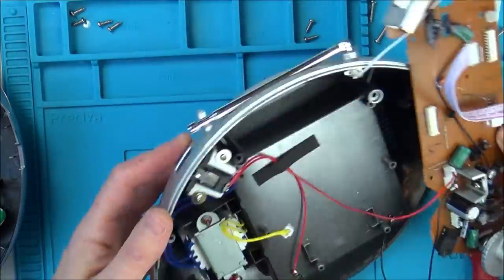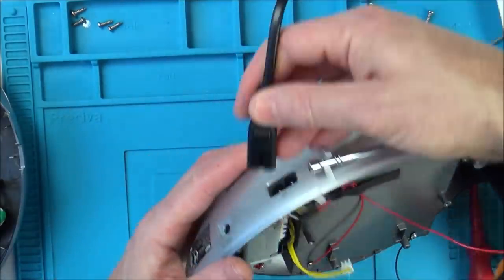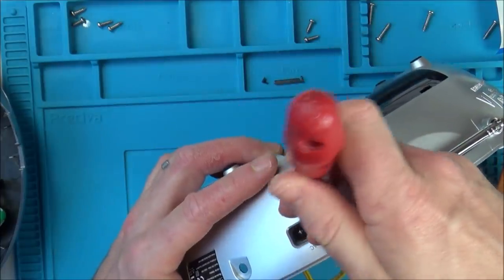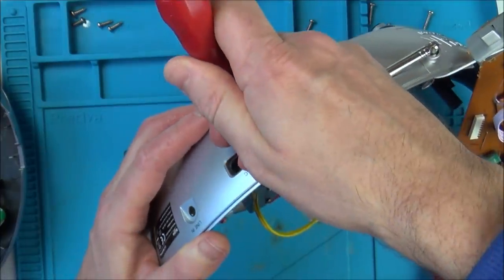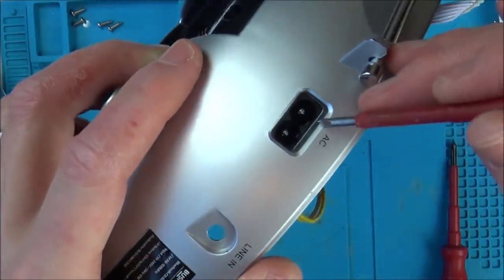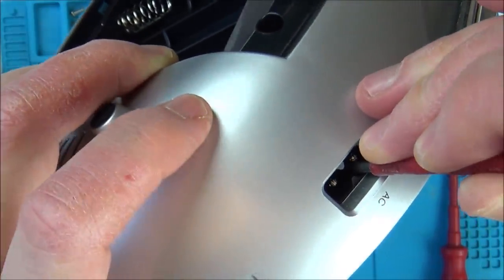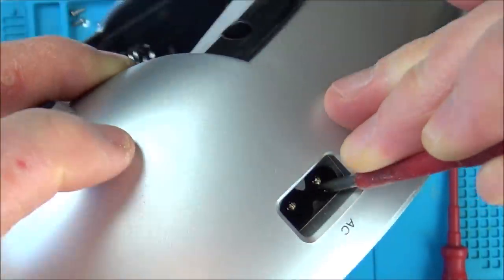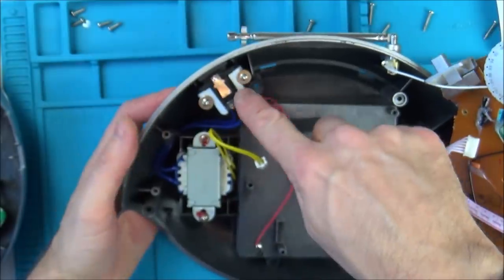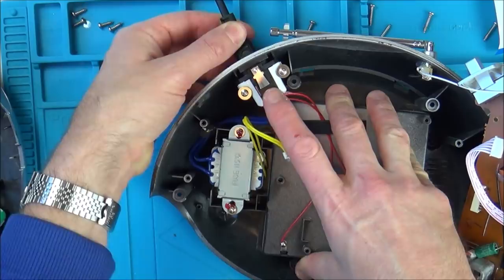So when you plug in, oh look, when you plug in, it cuts the power, so then you can use the batteries. Let's see what happens, how does that work? Oh look, there's a tiny little... Yeah, look, there's like a little switch on top there, a little black thing at the top. Apologies, you can't see that, I don't think. But when you press it in, in other words when you put the cable in, this switch will short together. So if we push that in there, can you see that's now shorted?